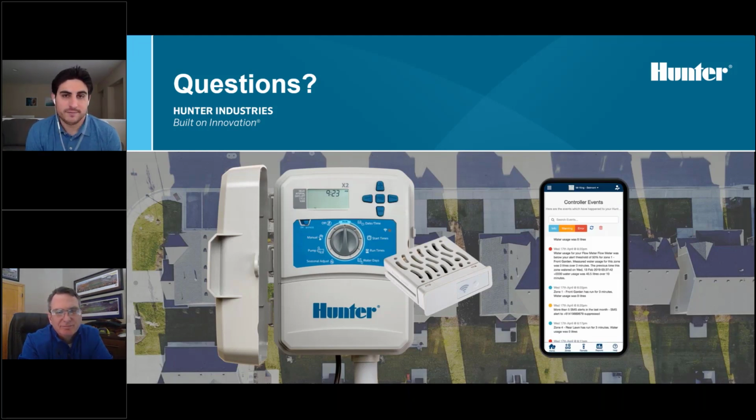But sometimes the controller internet might go down. It might lose connection to the internet. You might have a power outage in the area, and the controller flickered and disconnected real quick, and then has lost its network connection. So having the ability to wire in a rain sensor on site is a huge added benefit. Definitely, as I said, a fail-safe to make sure you're not irrigating in the rain.